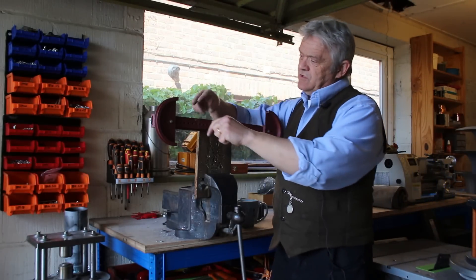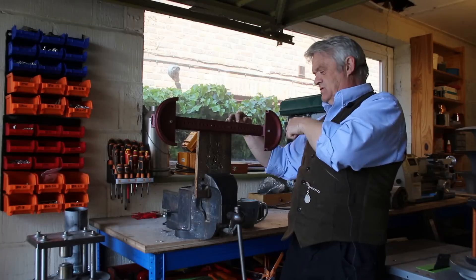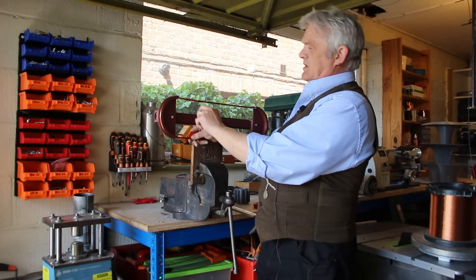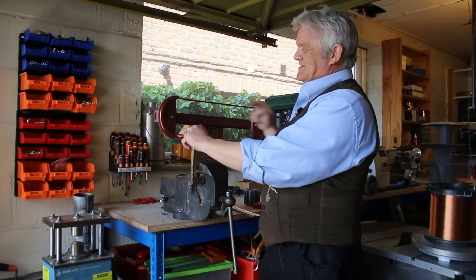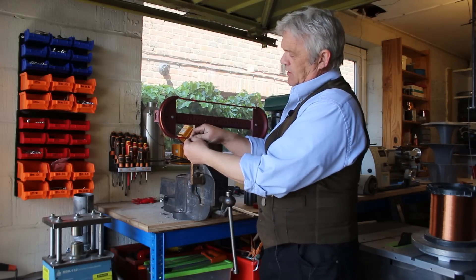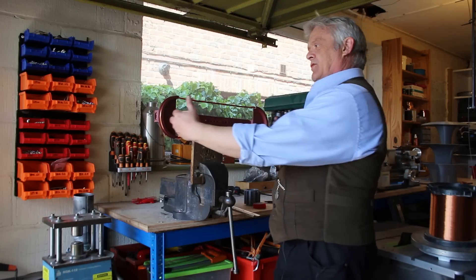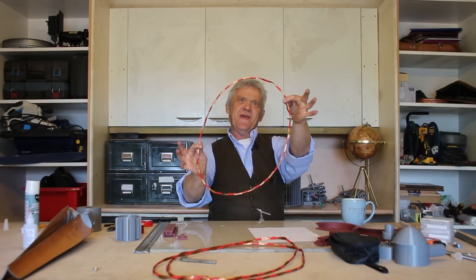To wind it, stick your wire through one of these holes so it doesn't come away, and then just wind — hundreds of turns. Once you've wound it, get some strips of tape and put those strips around the wire at the right distance. For me it's 6.5 centimeters, because that was the length, with a couple of centimeters to bend round. Without a doubt the bend is a bit too big at this stage — I was going to wind loads of these and would hone it down, but I quite like it a bit too big just to make sure it fits rather than having to squeeze it on with disappointment. Go along there and that will create the shape, then we can take it off the horse.